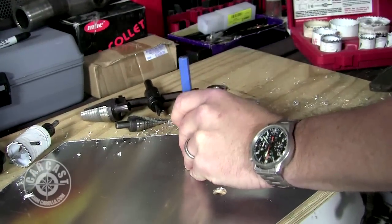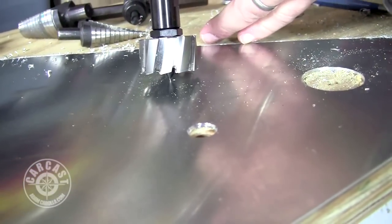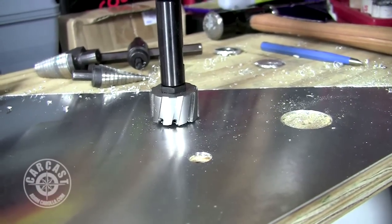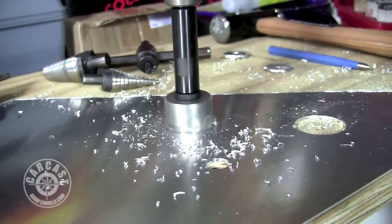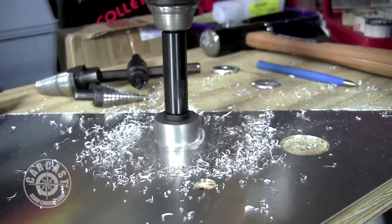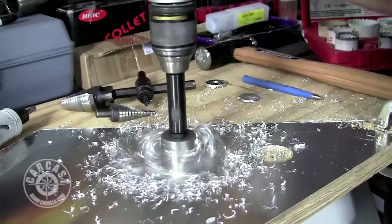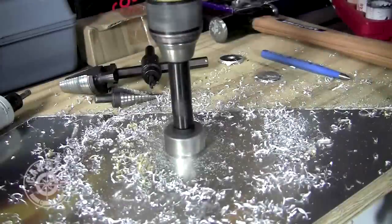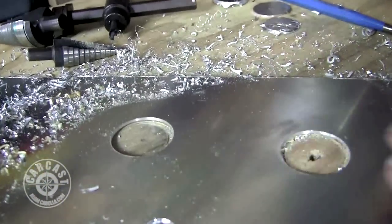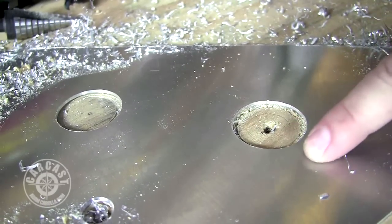Start with a center punch to put a mark for the tip to go, then drop it in. You've got to go easy because these things will spin out. They're really great for the drill press, harder to do handheld although you can — just start slow. Once you get a little edge going, it's pretty easy. It's smooth, it's not chattering — it's much nicer than trying to do the grinding hole saw. The hole it leaves is so nice and clean. The piece doesn't have a hole in it so it pops right out, no fooling around. Clear out the hole and it's perfect. The hole saw is not bad in this case, but you get the edge and a little bit of messiness — this looks like it was punched out.